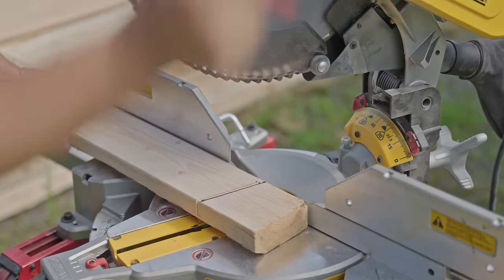It's time to get the waterproofing membrane out, get our next layers on. We're going to go through the whole assembly about our process for skinning this thing and getting it watertight. Remember, we're in a four season climate up here, so we have to deal with not just rain, but the risk of some ice buildup. We can get a weird weather scenario here where we can get a lot of freeze and thaw. And water likes to work its way under the shingles. So we've got to make sure we have a nice membrane on here. Make sure that whenever the ice is melting, we're diverting it out and around or even up under the shingles, but anything to keep it from going underneath the plywood.